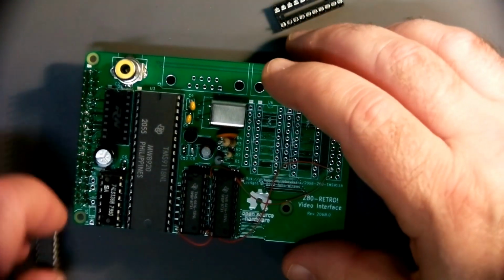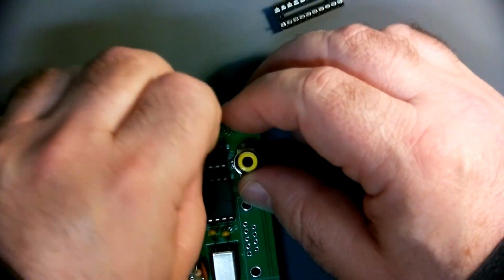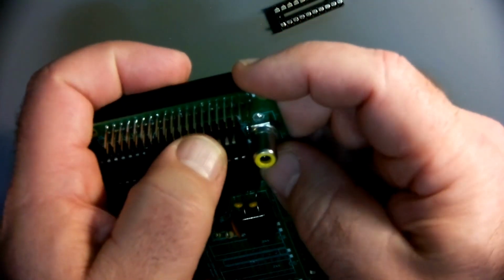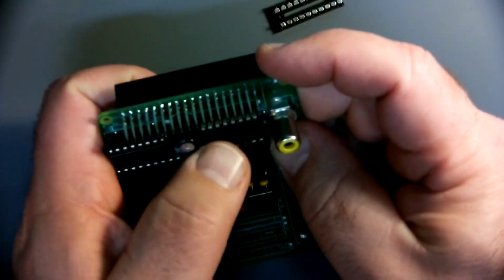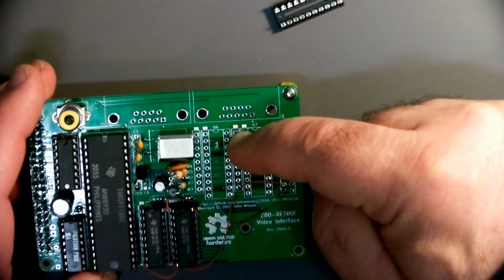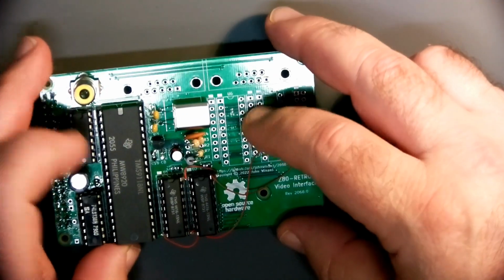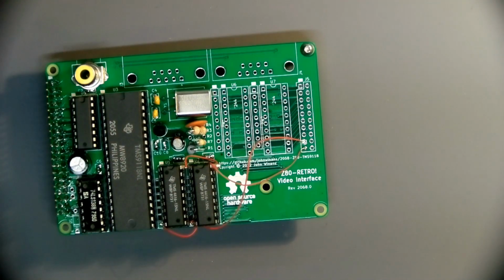So let's first test out the 138. It's kind of hard to get things in here at this point. Ooh, it's getting cramped in there. All these pins and jacks sticking out all over the place. All right, so this is all we really need to test it, because I can then come over here and check the output enable pins and write a little simple test app to do some read input operations on the correct port numbers and see if the scope pulses.